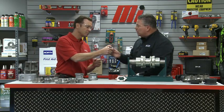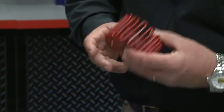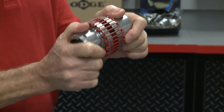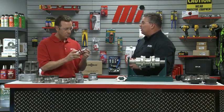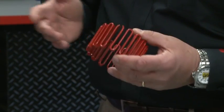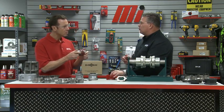How do we account for misalignment in a coupling that is made entirely of metal? Here is the Dodge Gridline. The Dodge Gridline utilizes a flexible grid element that connects with a series of teeth machined into the shaft hubs. This flexible element allows the Gridline to offer excellent misalignment capabilities, similar to an elastomeric coupling. Because of its metallic design, the Gridline has higher torque ratings and bore capacities, essentially giving the customer the best of both worlds.